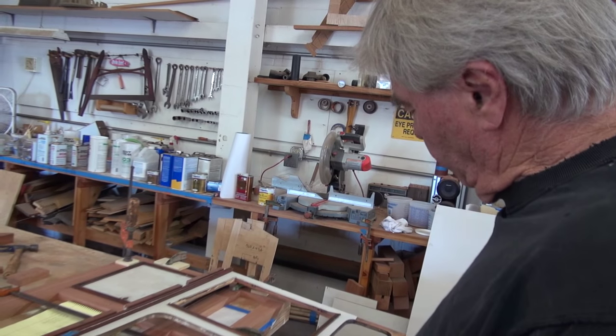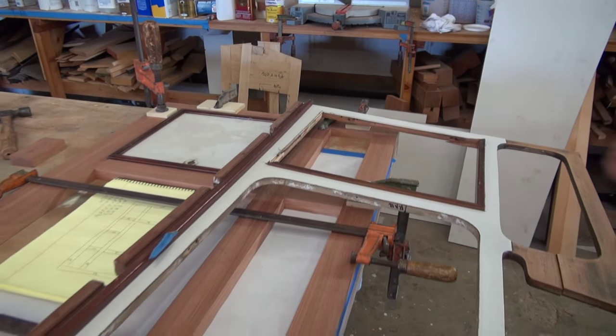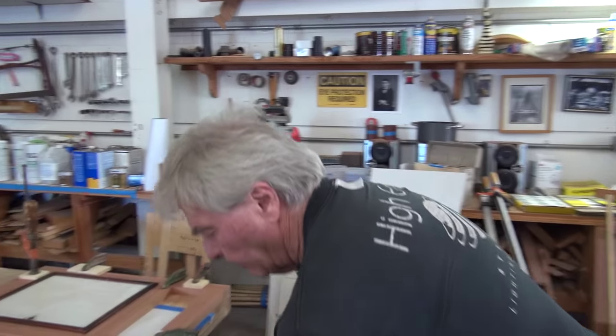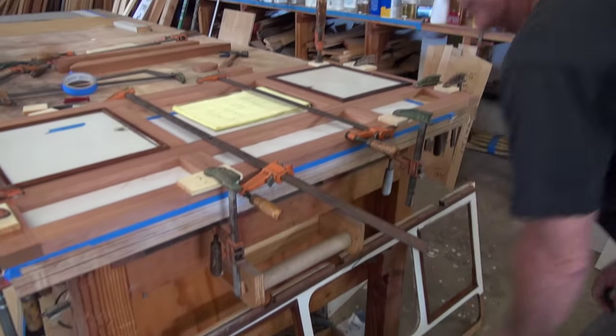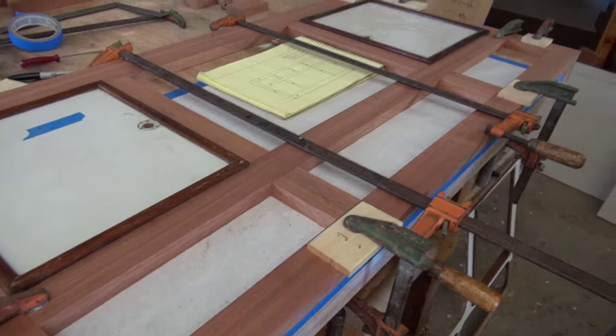It'll have a lot of taller lid storage. We'll round out the edges, sweeten it up a little bit. Making these pieces out of mahogany — not particle board and laminate. Are we putting veneer on it? No, just stain it and varnish it. Everywhere down below after the galley we've done satin varnish. We're going to do gloss here because it's the kitchen — easier to clean.